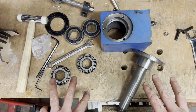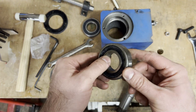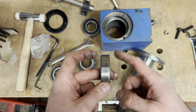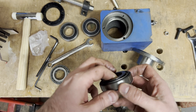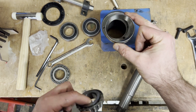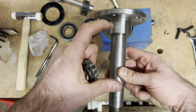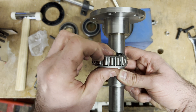Now I'll explain what's going on. These are the old bearings — they're just ball bearings, and when they wear they give you end float and lateral movement which can affect the chuck. The conversion is going to these taper bearings. The outer races go inside the main headstock and these then go on the shaft — one on each end.